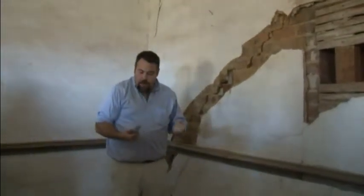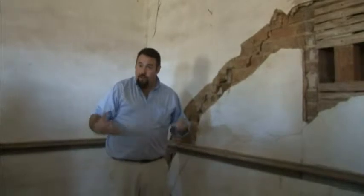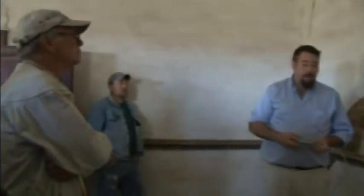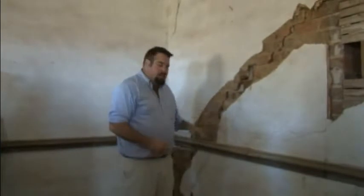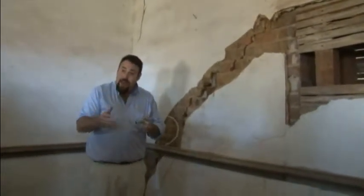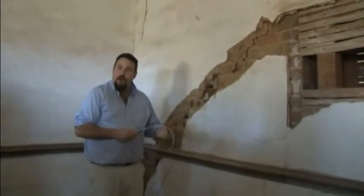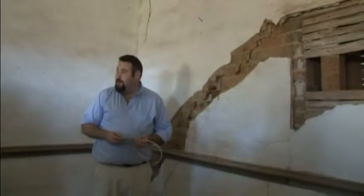This is a great way for a do-it-yourselfer or for small jobs. Other times you're going to be looking at equipment like grout hogs to pump a lot of material into the wall. The assumption is that there are just massive voids behind that? That's correct — there's been separation between the layers. You can see daylight through the wall, so there's a good chance that's going on behind the plaster. These grouts can also work well when you have delamination of plaster from the substrate — you can work a syringe with a needle or very fine hose into that crack and pump it that way.